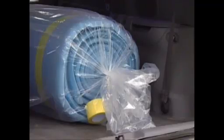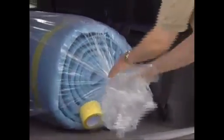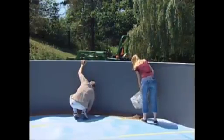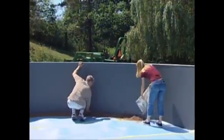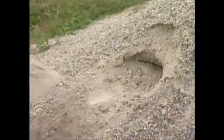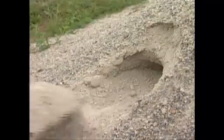You'll also need material to create a soft bottom for the pool. Many people choose brick sand for the bottom, but we've decided to use a foam bottom kit. In either case, you'll still need some brick sand to construct a smooth cove around the inside edge of the pool bottom. And you'll need a quantity of crushed limestone for the pool foundation.